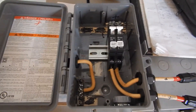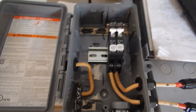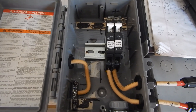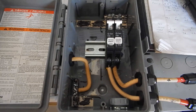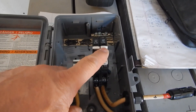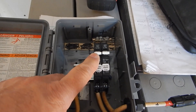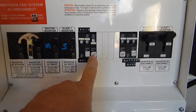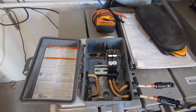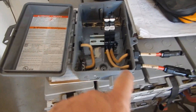I've got the Outback on. Next is to go out to the pole, take the breaker slash combiner box, mount it on the solar tracker pole, then tilt the panels down, measure the PV input home runs coming down to the combiner box. At that point I can do a systems check, turn the juice off on the upper three panels and the lower three panels in series independently with these switches, then push this little switch up for PV in on the Outback.